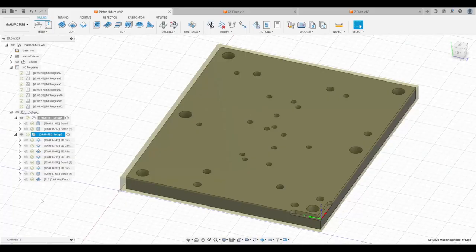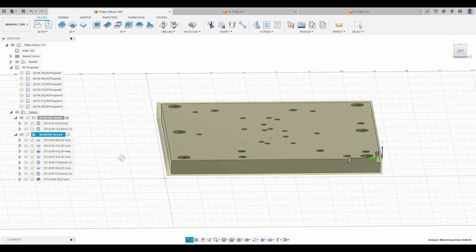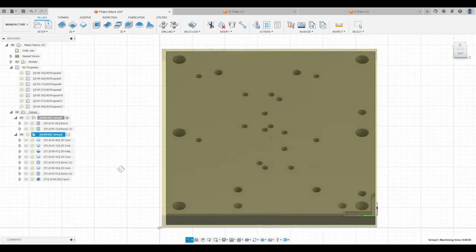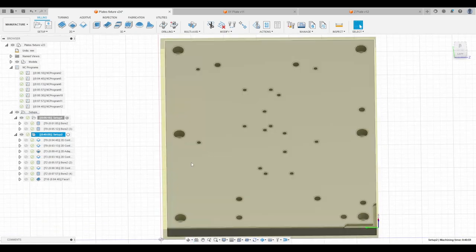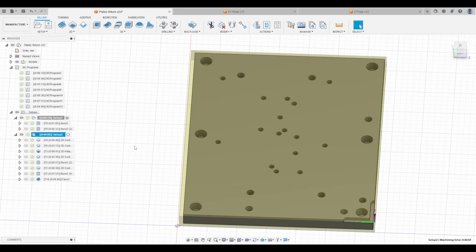Alright, so here comes the fun part, op 2, basically. I've now mounted the plate directly via the bores we just made to the table. And you can see I've painted myself into a bit of a corner here. Well, as you can see, the stock is a bit thicker in Y dimension as well. I ordered it 5 millimeters more, to be precise.